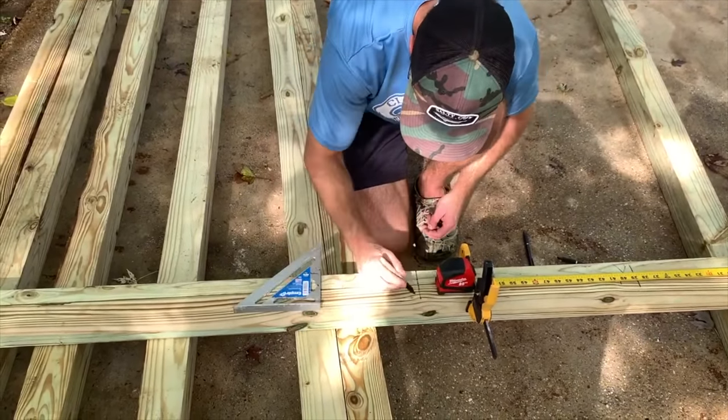What's going on, guys? So this video is all about how to install shed siding, but if you still need to learn how to frame your shed, you can check out my previous videos in the description. So T111 and LP smart siding are very similar, and they're the most common shed siding options in my opinion. They're basically a 4x8 sheet of pressure treated engineered plywood paneling. I personally think LP smart siding is a little bit better, but I have a blog article comparing the two that you can check out in the description.